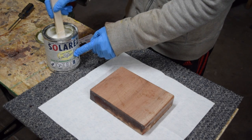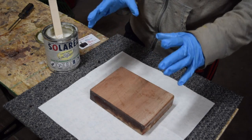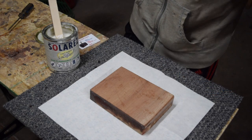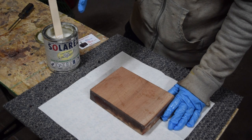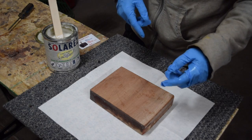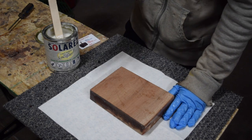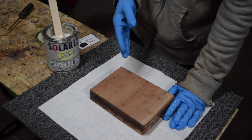This product, just like their other 'I Can't Believe It's Not Lacquer' clear coat, is UV curable. You want to work in a room without direct sunlight pouring in - make sure the curtains are closed and the shades are drawn. You have to be aware of overhead lighting, but unless you have high-intensity UV bulbs in your light fixtures, most fixtures aren't going to trigger a cure. It won't dry until you expose it to sunlight.